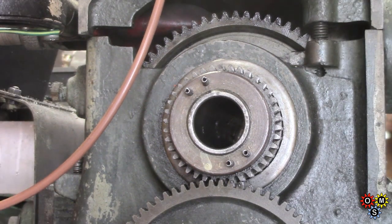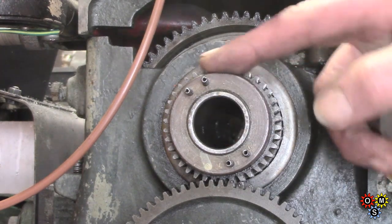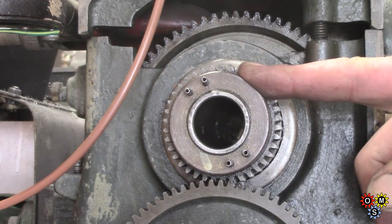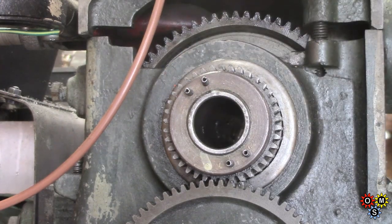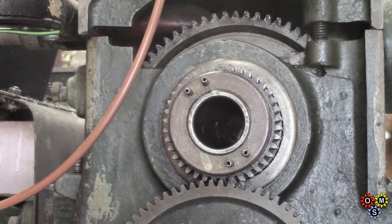Right, here's the deal. I haven't got a convenient spot to park the camera, so I'm a bit end on, but here's what we got. The end of the spindle, there's the collar for the trim and bearing take up. Now I've got these roll pins in here, which I did, I don't know how many years ago, and they suit to take my handle. Well, I'm not going to remove those. What I want is to get clearance for them.